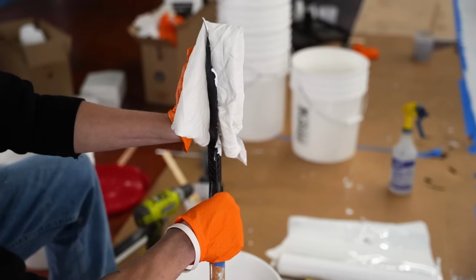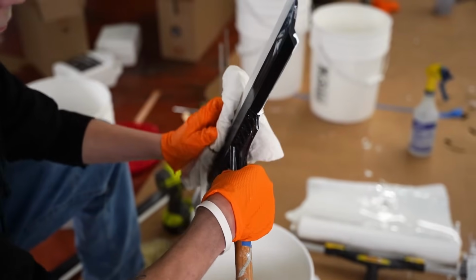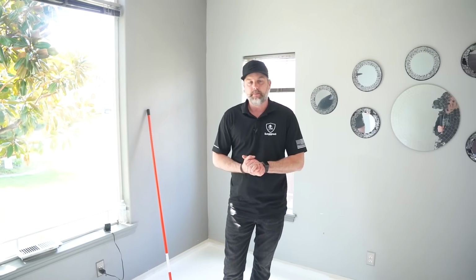So you can clean the squeegees off, denatured alcohol in a rag. So they're gonna start cleaning tools up. We like to just let everything set up, come back the next day because you're usually top coating, and then throw them in garbage bags. That way we're not dealing with sticky fluid epoxy in a bunch of garbage bags that could potentially leak out and make a mess.